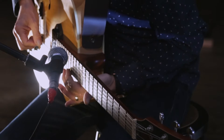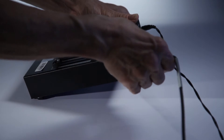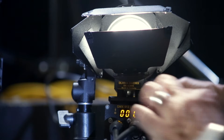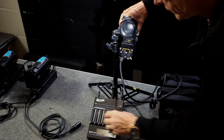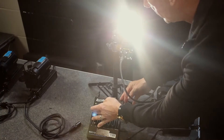So how does this work? The controller has an output of three or five pins. I'm using five pins here, and I'm going to set a cable in my controller, and that cable is going to go to my first light. Then I will press the two buttons on my light to access the program and give it an address — a digital address of 001, for instance. If I give my light the address 001, I will be able to adjust my light with dimmer number one.